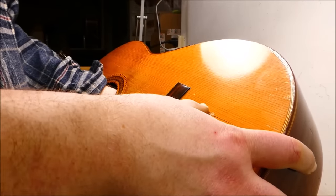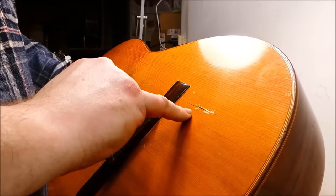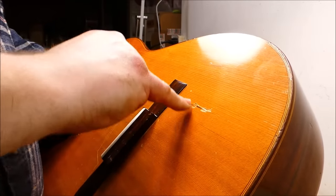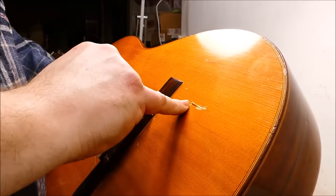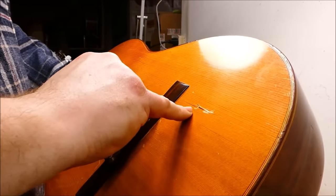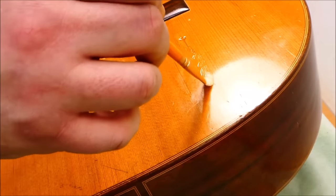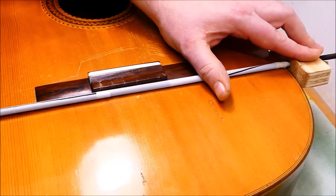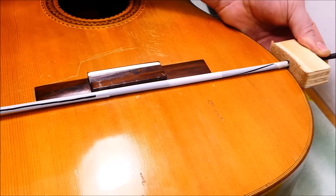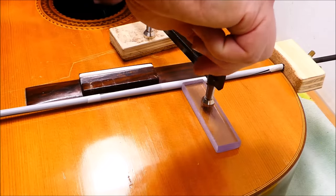I'm going to just slightly push this back into alignment. This tearing of the wood fiber means that I can't just steam this dent out. Sometimes if there's just a dent, I can put a cloth on it that's slightly damp and heat it up, and it will revive the wood and swell back to its former shape. But when they're cut like this, it's not going to happen. So I'm going to have to fill it with something. I worked a bunch of fish glue into the crack. I use a long homemade clamp across the lower bout to apply some pressure on that area, keeping things flat with a plexiglass caul on the outside and a cork block on the inside.